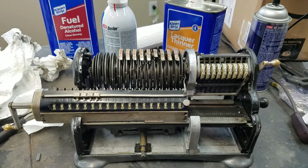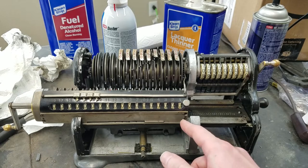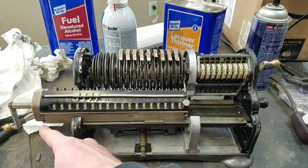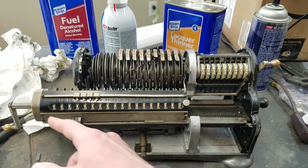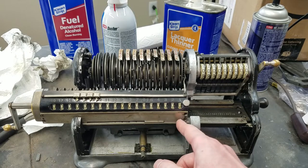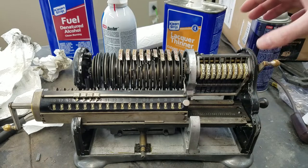There are two dowel pins that hold this in so I don't think it's going anywhere, but I'm going to do a thorough search of the box and work area to see if I can find that extra screw. I think I also need to find one screw for here yet. I think someone's worked on this carriage before because not all these screws here are the same size, but they all fit. This one over here was smaller than all the other ones — it's a good fit in this hole, but these other ones are too big to fit in this hole. I think someone messed that up. Probably should just redrill all four of these holes and tap them to the same size, but for now it's all in there solid. Definitely coming together pretty good so far. Let me fix that bell mechanism and then we'll put the cover on.